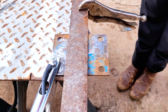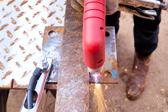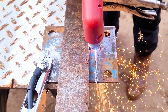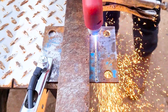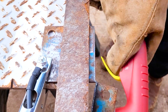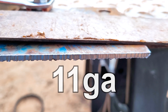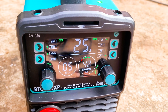Let's try some 1/8 inch, 11 gauge. There we go — the air compressor kicked on. We got a pretty clean cut, pretty clean kerf, not much dross on there. Running 25 amps on the machine.